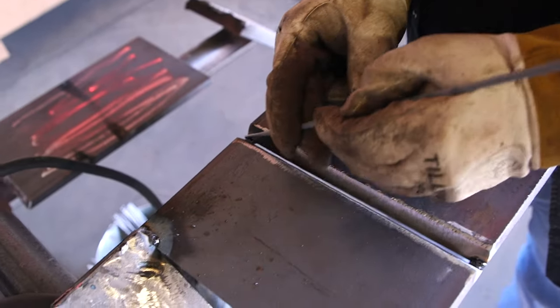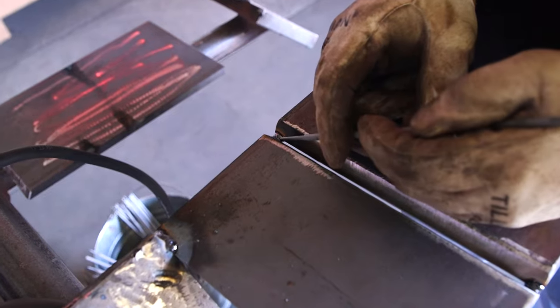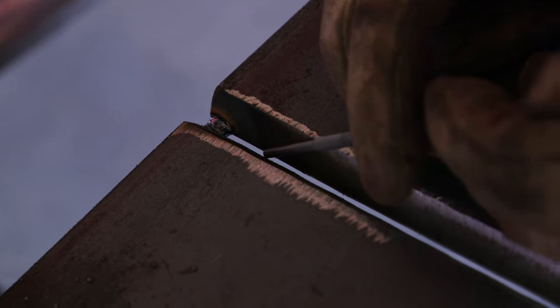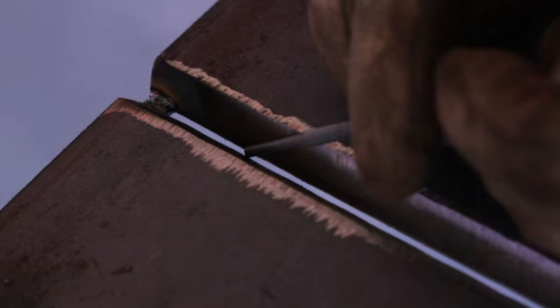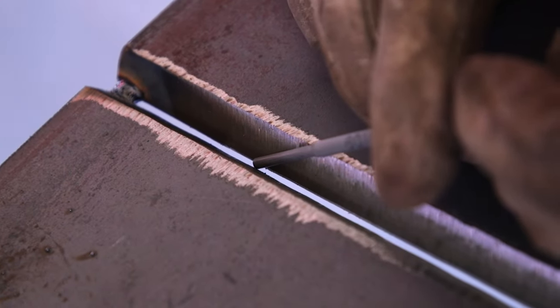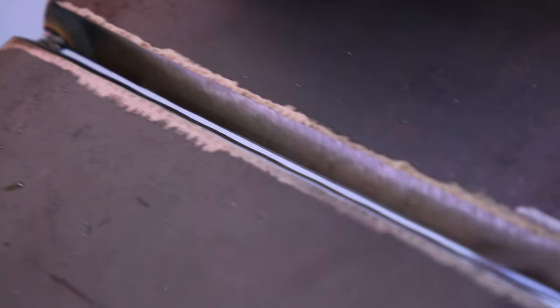I'm going to start right here and warm up where my tack is at. I'm going to go in and out of my puddle. Watch my puddle follow me as I'm going down this root, watching the keyhole keep moving in front of me while I'm watching the puddle follow my rod at the back, okay? Remember, always watch your puddle, never the rod. Back and forth, all the way through the end of the plate.